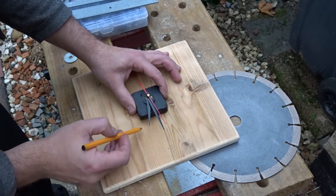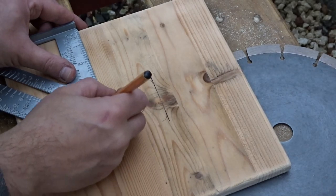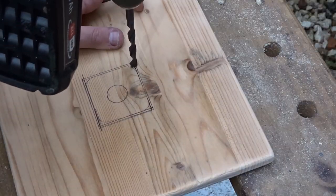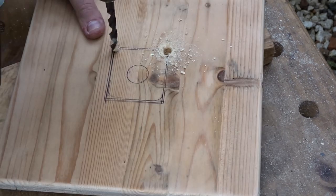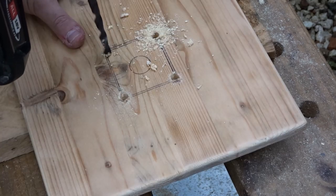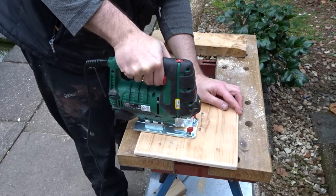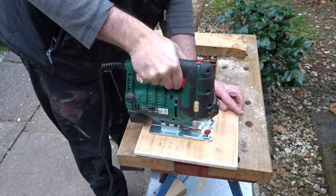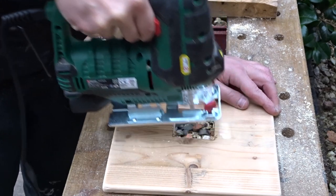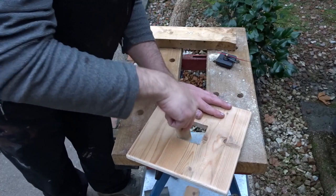I need to draw around the clock mechanism - I took this out of an old clock whose glass had broke, so I thought it would be great to use for this project. I'm just using the speed square to draw a square around the clock mechanism and now I'm going to remove this material. I'm starting off by drilling down so that I can get my jigsaw in, then I took the jigsaw and removed the rest of the material. This square doesn't need to be accurate or perfect, it just needs to be big enough so that you can get the clock mechanism inside. I made sure that the wood was as thick as the mechanism so that it could sit flush inside the base, then just went round the edge with some sandpaper to smooth everything out.